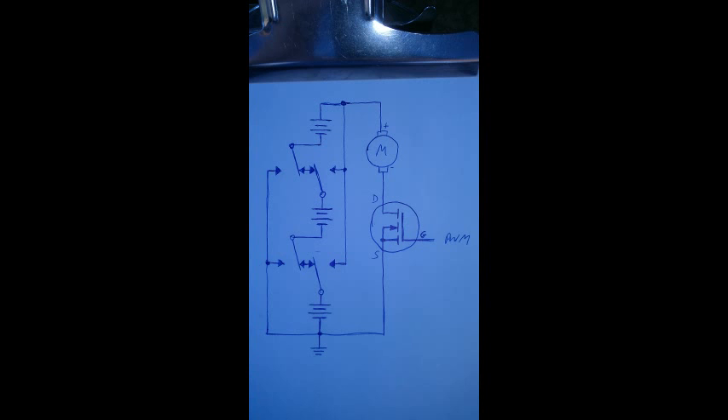This is a very rough draft schematic diagram showing the switching relays between the banks of batteries that automatically put them in series and parallel when I want to accelerate slowly, accelerate fast, or perform regenerative braking while the bike is coasting fast — putting a 12-volt potential across a motor that wants to see 36. The MOSFET is replaced by a third relay that is just actuating, turning the controller on and off.